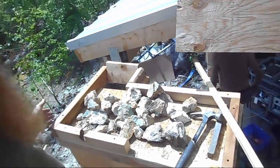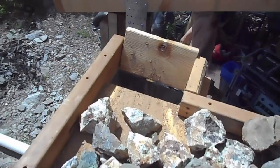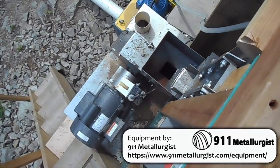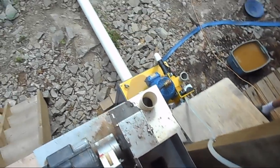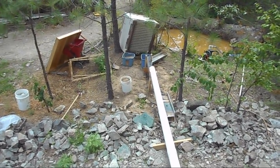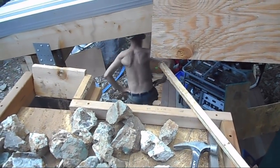If you didn't see our last video, we set up this nice little tray above the jaw crusher here where we can just lay out our material and then slowly push it in. It goes down in between the jaws and crushes, then falls into the impact mill and powders it, which then feeds straight into the Icon centrifugal concentrator. It concentrates it and then off into our long tailing chute — a little inspection sluice at the end — and then back to our tailings pond. That's the whole process. Let's start crushing.